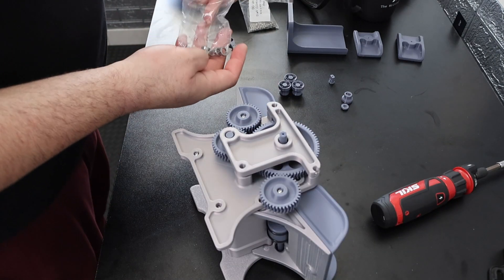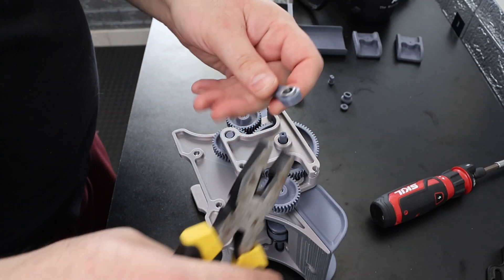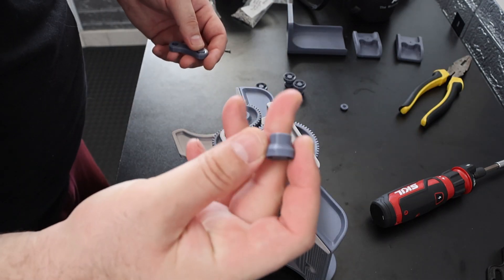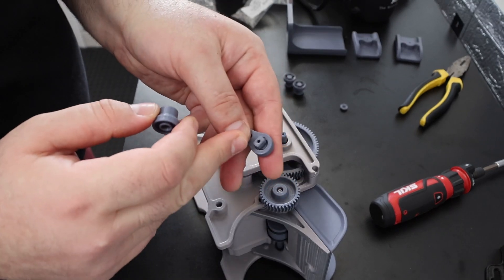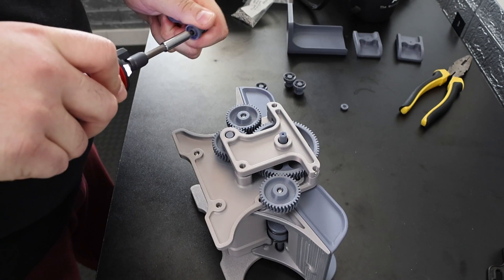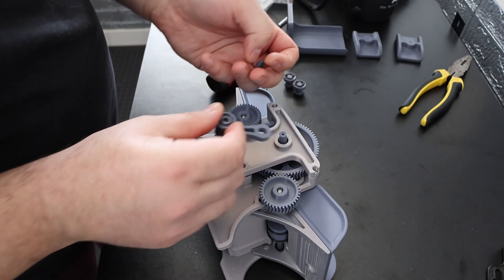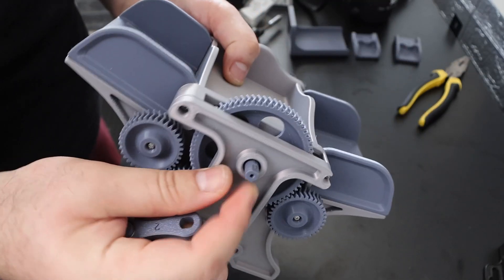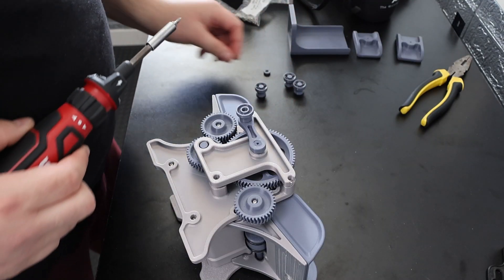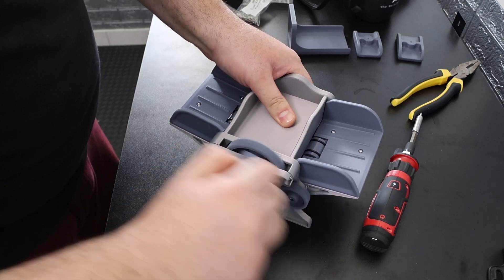For this next part we'll need one ball bearing and one screw. We grab this next piece, pop in a bearing in the back, use pliers to make sure it's flush, then grab this little post and stick that through. Then we grab the knob and simply screw it into place, lining up the holes — you can tell they're meant for each other. That's rotating nice and freely. We grab the cap and put it on top, screw it into place, making sure the flat piece on the tip is facing up, then install it. We grab a screw and that cap and screw it into place. Let's see how this thing spins — very nice.